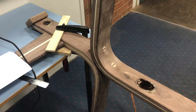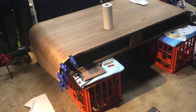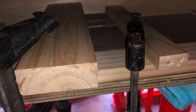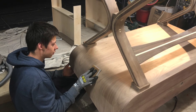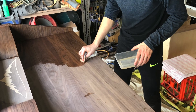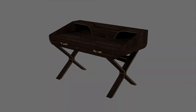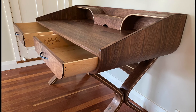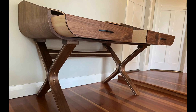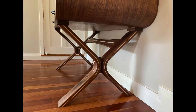I began the final process by perfecting my project once all construction was complete. I did this by filling the knots with epoxy and covering gaps with additional veneers. I also glued in the drawer runners and stoppers. I finally began sanding my entire project through the grits and then applied two coats of an Osmo semi-matte finish. Overall I'm extremely happy with how my project turned out, finishing in the required timeframe with no major design changes. This project looks better than what I thought was possible and will provide me with a large, stylish at-home workspace.